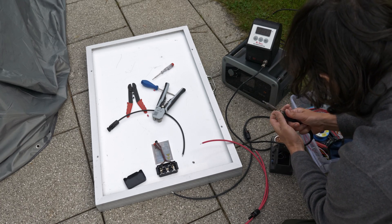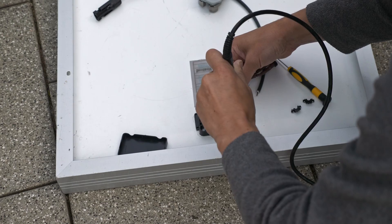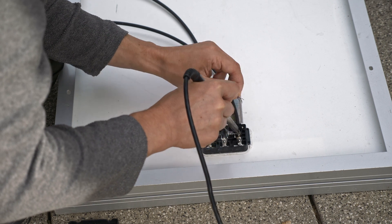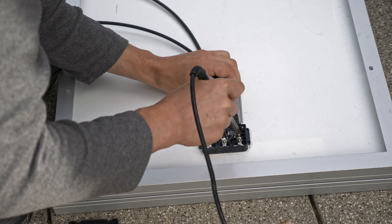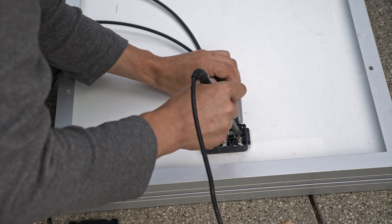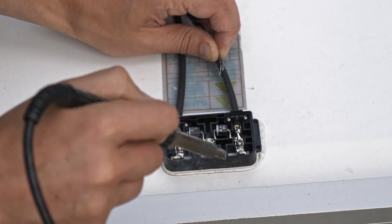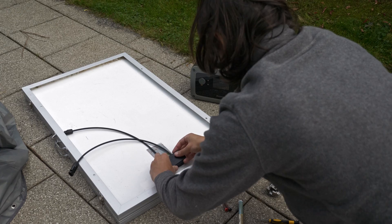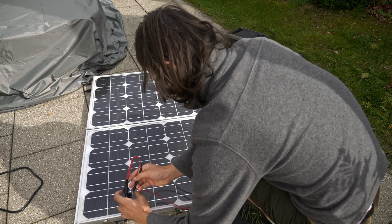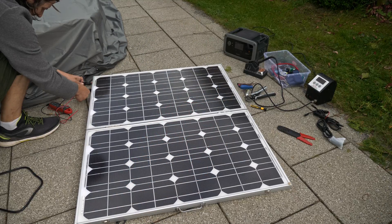Since the old cables were soldered, I took my 100 watt soldering station with a proper chunky tip to get the terminals heated. After removing the old cables I took a bunch of solder and kept heating the wire ends until I could see the solder creating a concave bonding puddle between the pad and the wires. I checked the voltage and polarity — the thin end of the connector should be positive from the panel and the receptacle should be negative. That was ok.